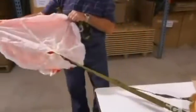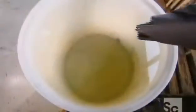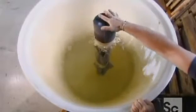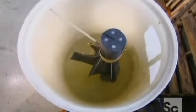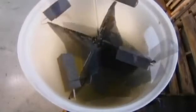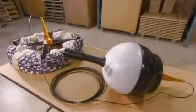Another buoy type has a parachute, because it's designed to be dropped by aircraft in a search and rescue operation to mark the location of an incident. As the demonstration shows, the buoy opens on impact. All the components are spring-loaded — floats made of foam, drogues around a central cylinder housing the instrumentation, and on top, an antenna. The buoy packaging is water-soluble and biodegradable, so over time it simply disintegrates. No need to retrieve them.